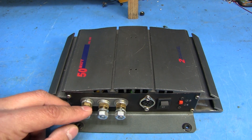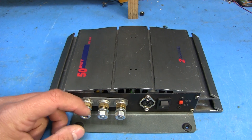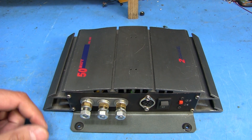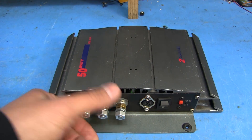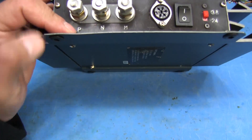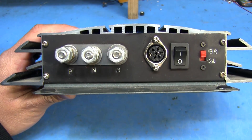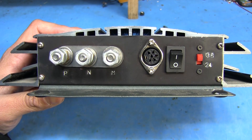These connectors here are for battery and the motor. I wanted to make it a little bit flexible so that I could easily remove the motors and batteries if needed. It's just a few nuts and some washers. There are three connections: the positive, the negative, and then the motor. So this only controls the motor in one direction - once it's hooked up you can only go forward or something.